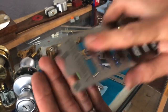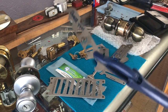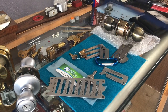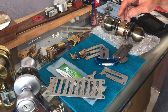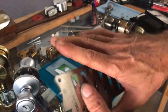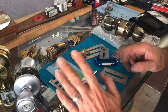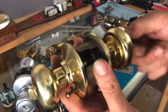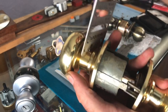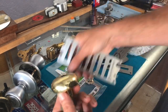Now we're going to try the clip removal tools. Nobody really uses euro cylinders here in the US, so that's more for overseas. The wider clip removal tool gives you a better grip. I've got some locks here to try it on. Starting off with Schlage — let's try the poker. It worked, key out, get the cylinder out.